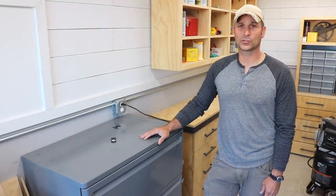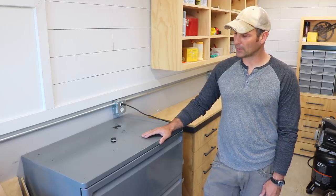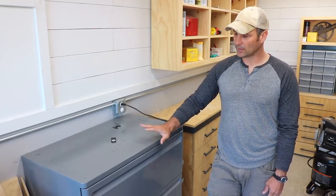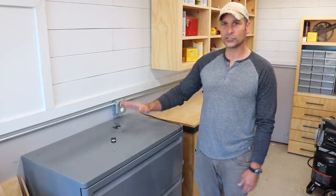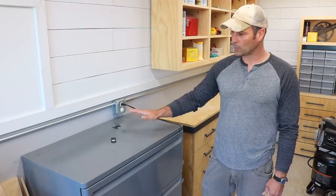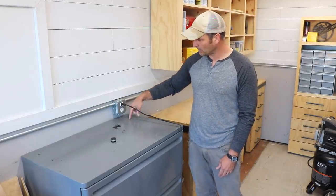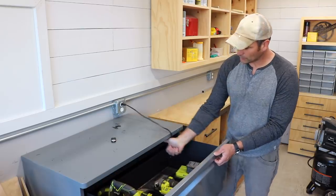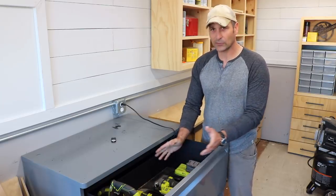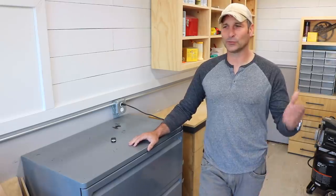The last thing I'm going to do as part of this random assortment of shop modifications is put a workbench top on this file cabinet. If you've seen any of my previous shipping container shop videos, you might remember that I started using these file cabinets as shop and tool storage. They hold a lot of weight, protect your tools from dust, and keep everything nice and tidy. But they are made of sheet metal and the tops are a bit flimsy. So if I put a piece of plywood on there with a coat of polyurethane, I'll have a nice, sturdy, robust top. I'll also be drilling a hole so I can feed my battery charger cord up through the inside — I like to keep the battery charger inside so if something ever happens, it's contained in a metal box and won't cause a fire.